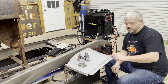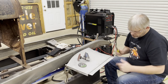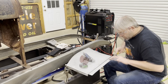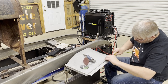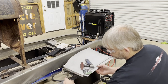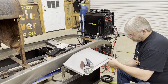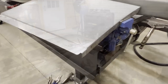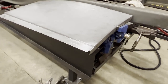Alright guys, I got the grinder work done. I need to dress off this corner — this really sharp tight corner down in there. I think a corner file will do the trick, and I'll probably just file some of the other areas too. Just dress it off, make it look good. It's TIG welded, it's ground down, it's filed — looks really good. I think it's ready to put back on the car and test fit it to see how it looks.